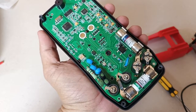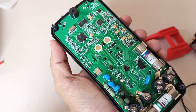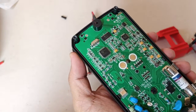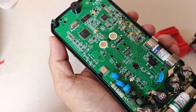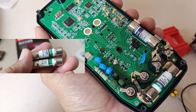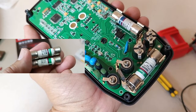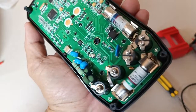As you can see, there is a separate fuse for the 10A range input and the micro ampere/milliampere range. One is rated at 11A, while the other one is rated at 440 mA. They looked legit and they are quite expensive. I keep a few of them myself as spares for my digital multimeter. If I'm not mistaken, they are rated at 20,000 ampere interrupting capacity.